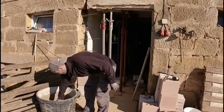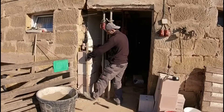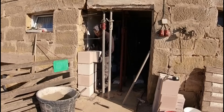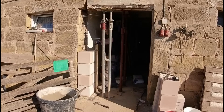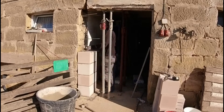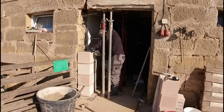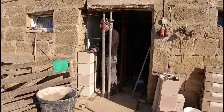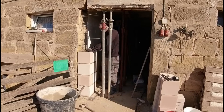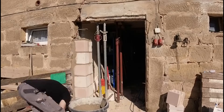As you can see, I have put in plenty of connectors — plenty of anchor rods — to really achieve the best possible bond between the old wall and the new wall. The joints will of course also be pointed in between, no question, but what is important is that these threaded rods are properly bonded.